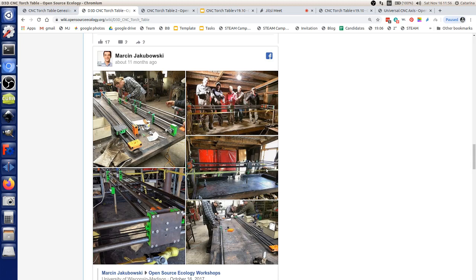The fuel system: we're going to have three on/off switches for gas. For oxy-fuel, you have oxygen and acetylene mixed together. You can light just the acetylene channel. You add some oxygen to get a clean flame, because the acetylene flame is yellow and smoky — adding oxygen turns it into a hot blue flame. The third item is the cutting oxygen lance: a stream of higher-pressure oxygen down the nozzle that cuts by heating the metal to red and white hot, then turning on the cutting oxygen, which oxidizes and burns everything through.